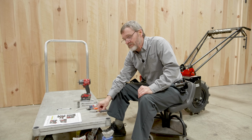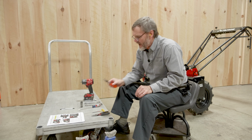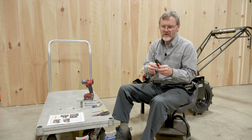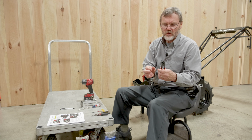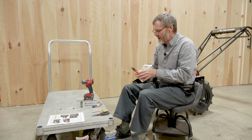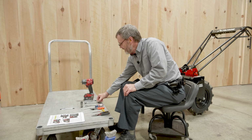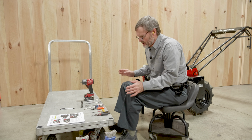I've got a needle nose pliers, a 1/8 Allen wrench, and if you have one of these snap ring tools, this one's a .047, that talks about the tip of those so that it will go into the hole in the snap ring, and it's set so that I can squeeze, which would open up the C snap ring. Screwdriver just in case, 9/16 wrench and a deep well socket, 1/2-inch wrench socket, and my impact tool and a short extension. That's all you need.